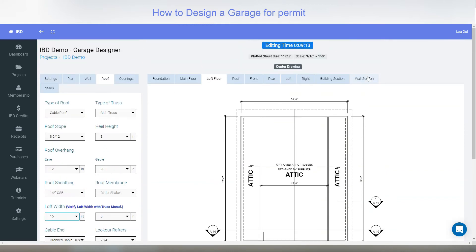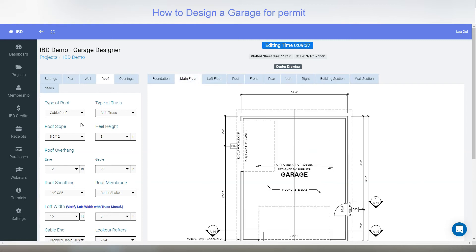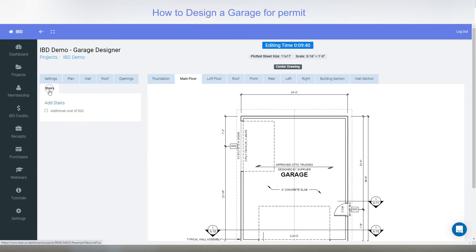You can come down here and change it to make it wider, though we know it likely can't be much more than that. You can also go into the building section and actually see it there. Ultimately it'll be up to the truss manufacturer depending on load — they'll tell you the maximum size. But to have stairs you must have attic trusses because you need to be able to get up there.